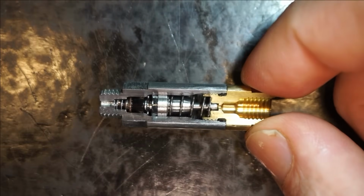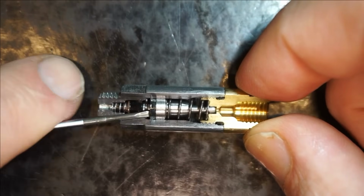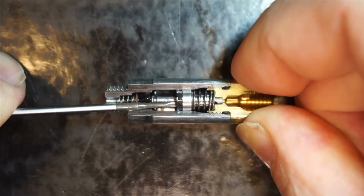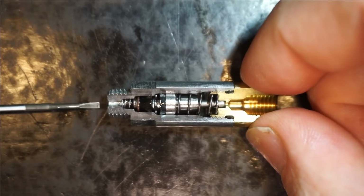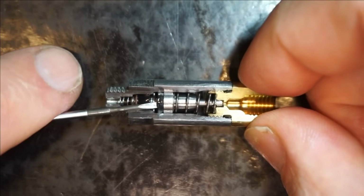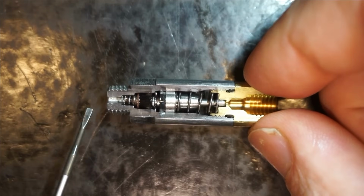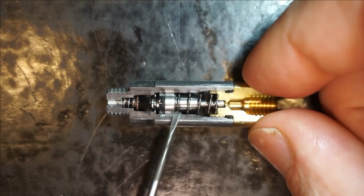And the other thing that we can learn from this is that the whole metering function of these piston distributors is only given if we can make sure that their pistons hit the end stops. So you see, we have to make sure that the volume that our pump supplies is enough to move all the piston distributors that we have installed on the machine to their end stops. And the pump must supply all that volume in one shot. So you see, we have to size the pump accordingly so that all the piston distributors on the machine can do their job.